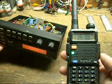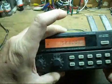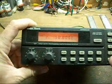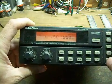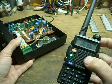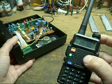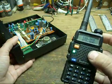If you just want to test the functionality that the receive works on a little handheld or another radio, you don't even have to do anything more than that. Just know what the local oscillator offset is, type in the frequency, and you've got a quick, easy receive test source. I've programmed in 158.805, 158.8, and 158.795 on three channels and done a quick scan — giving you a three-frequency test pattern that's pretty obvious and easy to spot.